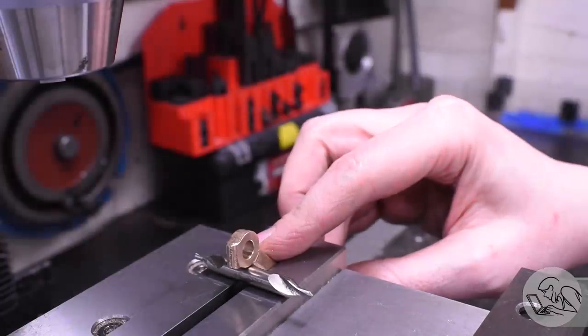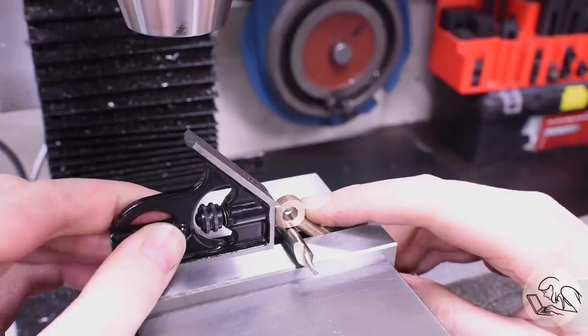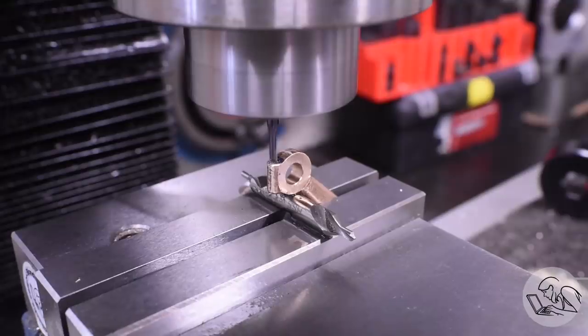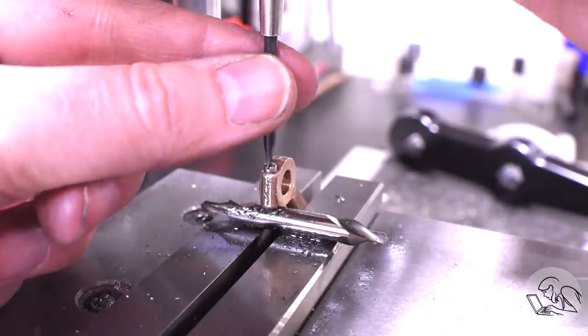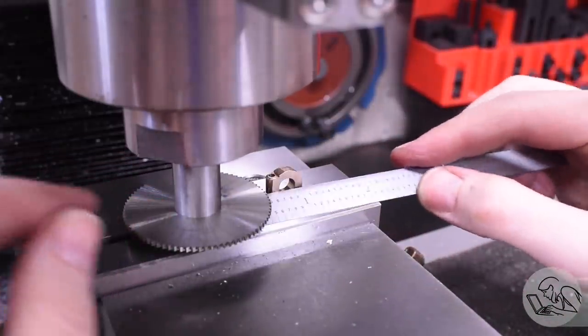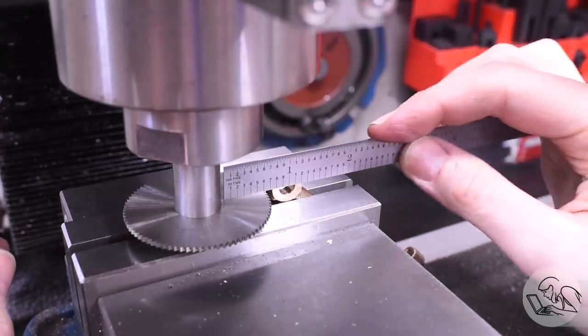Now the big end is a strap, but the little end is actually a clamp. I've been abusing that word clamp previously, but this is actually a clamp. So we do the same operations as we did before on the boss for the bolt, but note that there's only a bolt on one side. And so now we're going to split that boss, and then this thing is going to be a clamp that clamps on the pin that goes in the crosshead. So this thing actually retains the crosshead pin in place by clamping on it. It's actually quite a clever design that I like quite a bit.